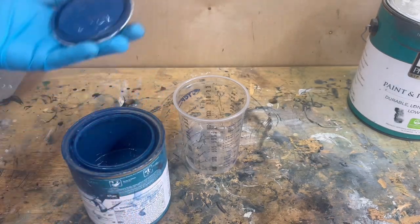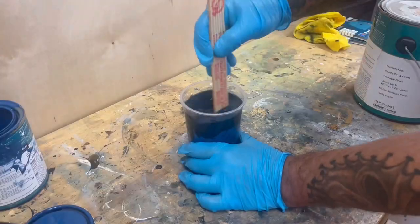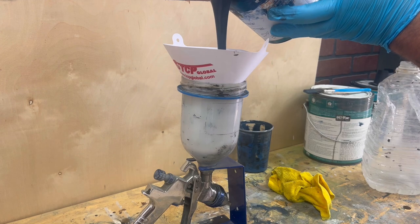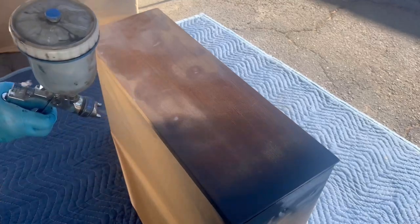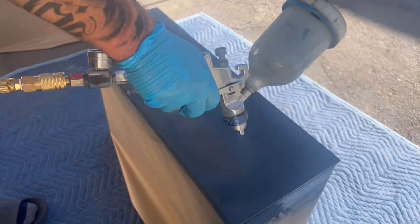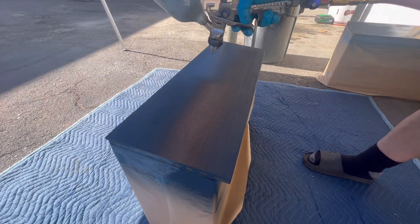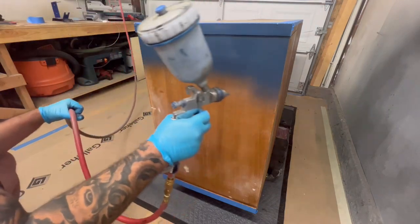For the paint color I wanted a navy blue with a little gray mixed in. I have this blue by Behr called Express Blue and my favorite color Limousine Leather Black, so I mixed those together with a little water to thin it out. Then I added a dark gray color — I never checked what it's called — to get a nice dark navy blue. It's a custom mix and luckily I mixed enough to cover the entire piece without having to mix more. I get a lot of questions about why I don't use primer — I do have primer and I've used it, but with darker colors it isn't always needed, especially since this paint has built-in primer. I do three to four coats, so my first coat typically acts as that primer coat and lets me see any imperfections I may have missed when applying wood filler.